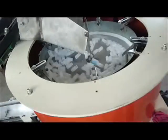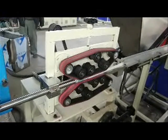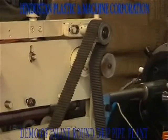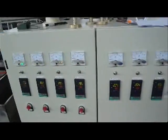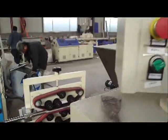The machine adopts a centrifugal principle to sort the drippers. It is fitted with a real-time belt conveyor and decelerating motor. The conveying of drippers is controlled by a highly precise servo motor, and up to 250 drippers can be inserted per minute. The spacing between two drippers is controlled by servo motor and can be changed by PLC.